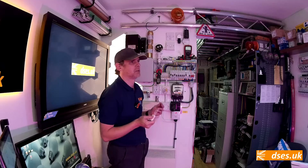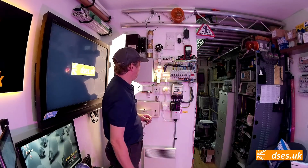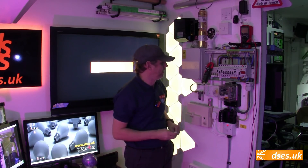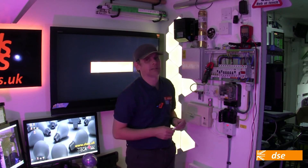With it off, I can confirm it's cool to the touch and ought to be perfectly fine. So a high value resistor would do the job. With the TIS 560 clamp meter clamped around the feed, taking the lamp out of circuit so it doesn't skew readings, the display shows 0.47 milliamps — 470 microamps, near as damn it to the calculated value. With or without the lamp, you've got this resistor drawing that small amount of current all the time the light is on, so we're burning power for no real benefit.